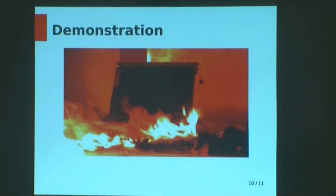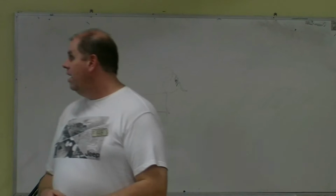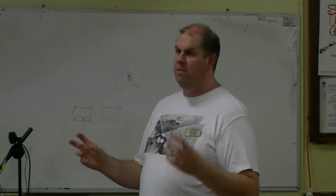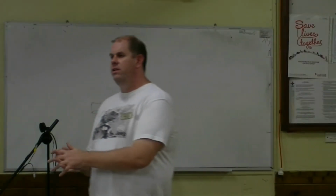Okay, so the three different tiers, different levels of the technology. So Tier 1 is the first level of DMR. It's a very crude frequency division, FDMA kind of architecture, one frequency, one time slot, as I understand it. Tier 2 is the TDMA, it's the one that we've been talking about today. And that has two time slots, multiple talk groups. Tier 3 is a newly emerging technology that actually uses a lot more bandwidth. It does spread spectrum, a different form of encoding. Not necessarily compatible, but some Tier 3 radios may support Tier 2. So they may support legacy support. Yeah, legacy support. Yeah, that's right.